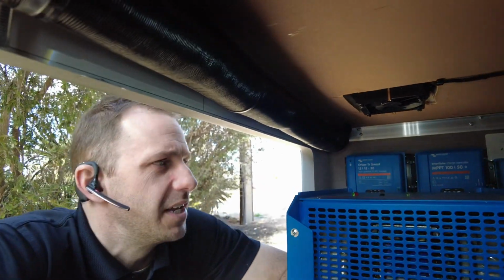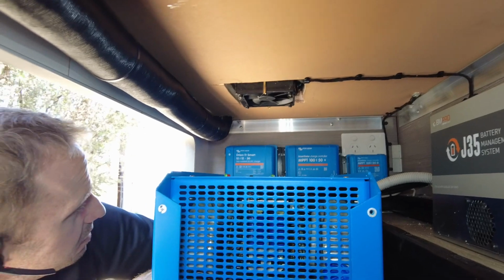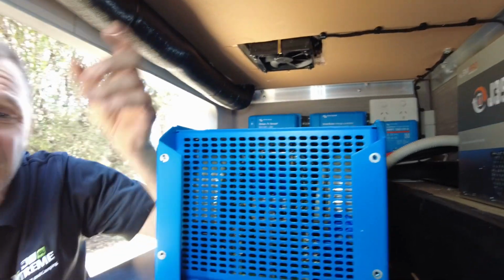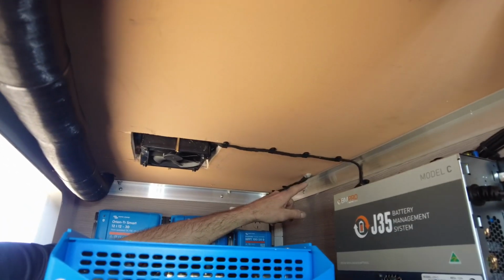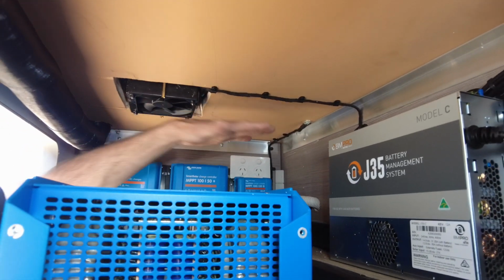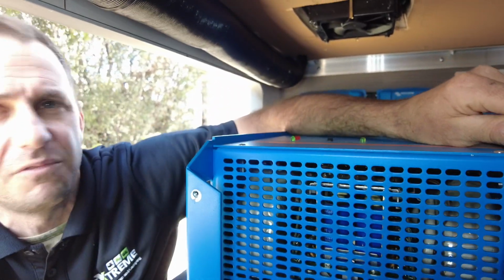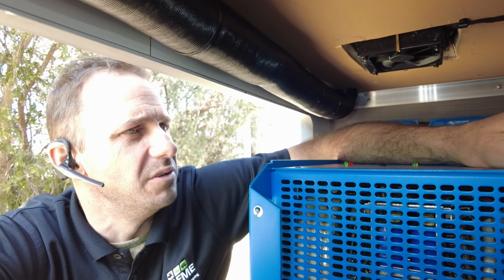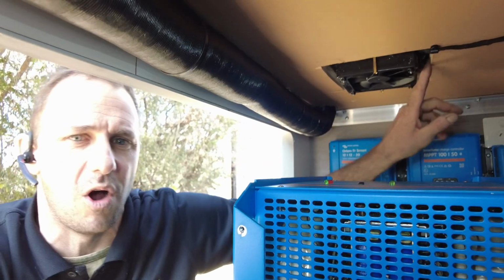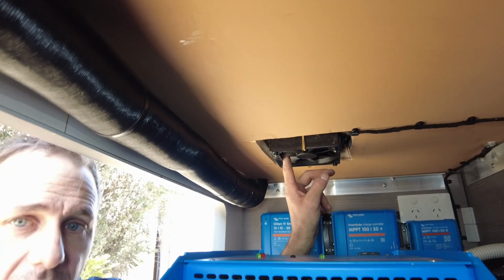And this was quite a tight little location to get it into. You can see what we're working with, and ventilation, we had to consider the layout because of the diesel heaters. We had to work out where was the best place, and because we've got the temperature sensor in here, we're able to monitor this heat build up in here. Under full load and running it for a long time, I think the best it hit was like 38 or something. It was bugger all. So now that this is right at the top, at its highest point, this is fully controllable. It's always venting though, mind you guys, it's always venting.